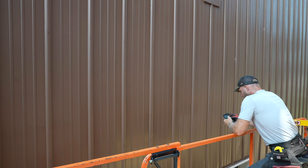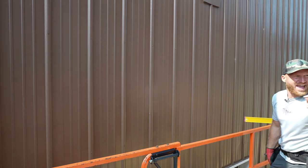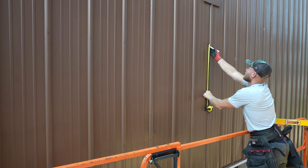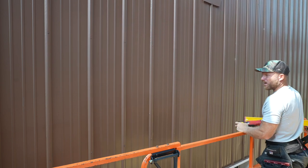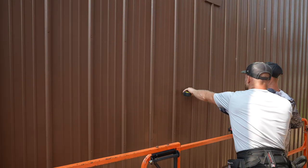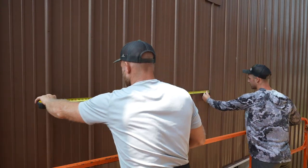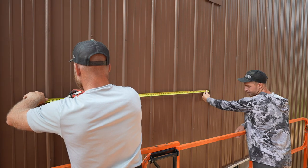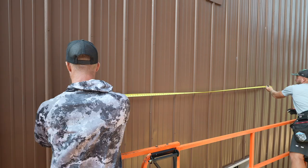5 foot 6 inch run, 4 inch pitch. Oh yeah, 22 inches is the top of that. So that is my peak. Now what I can do is measure out. Are you gonna hold me? That's your center mark? Yeah, just hold me on that mark. And I'm gonna come out here. Burning your foot or not? No, that's fine. 5'6". Should be right there. Yep, see it. 11 feet.